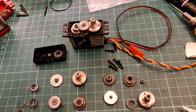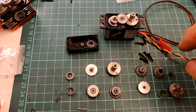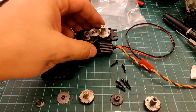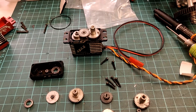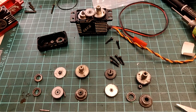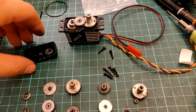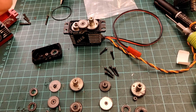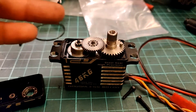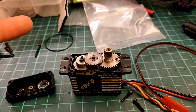I'm going to show the gear sets here. I've already gone through two sets of gears for this particular servo. I have it running in a TRX-4 in an Ultra Four car-style truck, so it's pretty brutal on the servo. I'm not entirely surprised it failed, but it fails pretty spectacularly. This is a new gear set I've put in from spare, but the servo is currently completely broken and unrepairable even with new gears.